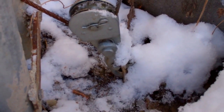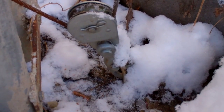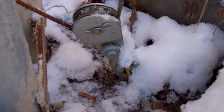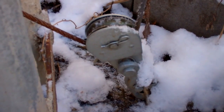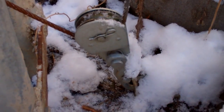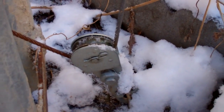From the winch, the cable goes down to a pulley which is secured into the concrete by a U-bolt and a couple of washers. The U-bolt actually goes into the ground 8 to 10 inches — it was really long — and I put several washers in there so that when the concrete froze up it would hold it in really tightly. On the end there's a U-hook that the pulley is attached to, which allows it to pivot and gives some added mechanical force.